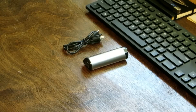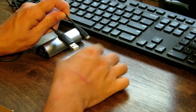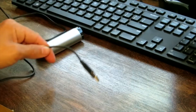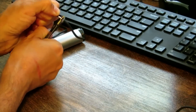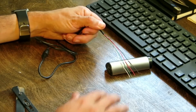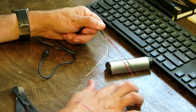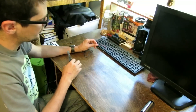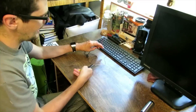We're going to start with the spare battery pack provided in the link in the description. The smaller end is going to be the input for the battery charger, so I'm going to want to leave as much cord as possible up to this end and cut off the larger end. Now you're going to see four different cables inside your USB cable. The green and white wires are used for data — these are irrelevant for our purposes. We're going to focus only on the red and black, and you'll want to remove both of the data cables by cutting them back as far as you can so they don't interfere with the power cables.